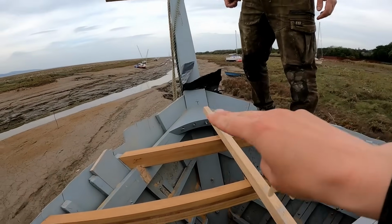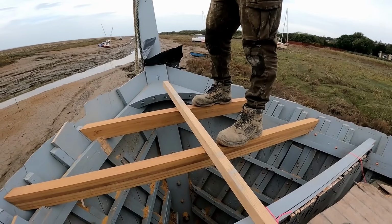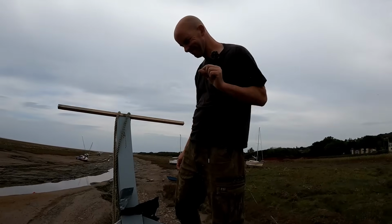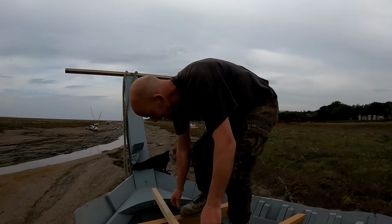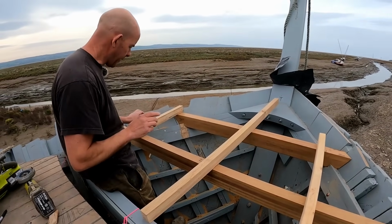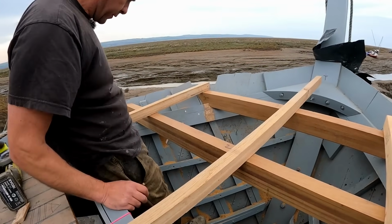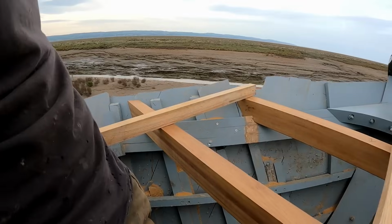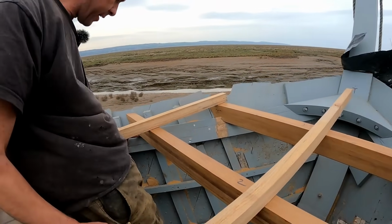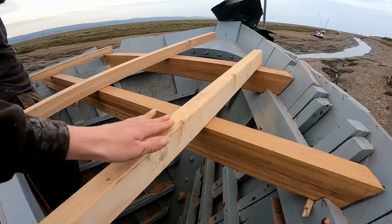Yeah, but we've also still got the longitudinal bits to put in as well, haven't we? Yeah. Okay, we're getting there. Keep just working at it and bringing them down. Yeah, we're at millimetres now. Like a couple of mil. Can't cock up now. No. Getting there. Middle's very close now. We've got a tiny bit on here, so I'm going to relieve it ever so slightly there, and then this one's good, doesn't roll.